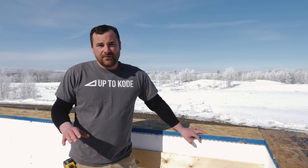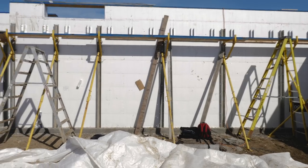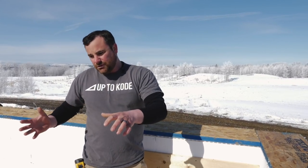We're up on our scaffold right now, a couple days before we pour these walls. Keep in mind that some of the bracing you see helps hold the walls while we pour, and it's also built in so we can string-line it and get the wall super straight. We want to show you how simple it is: just keep going with the ICF wall, hang your floor system off the wall, stop your concrete pour at whatever height you want above the floor system, let it cure, pull the scaffold and bracing down, bring it all up to the main floor, and just keep stacking the block. Essentially, if you can do the ICF basement once, why not do it twice — and then your whole house is done out of ICF.